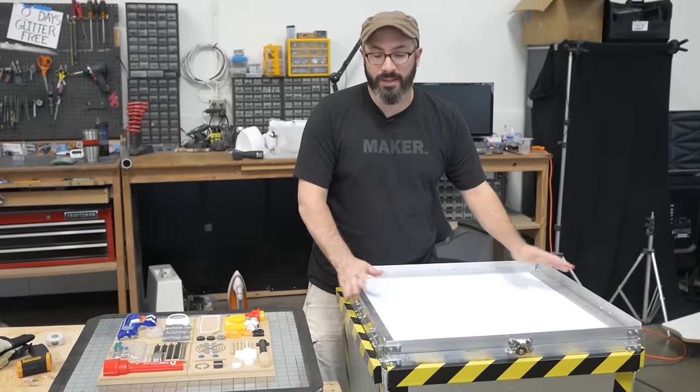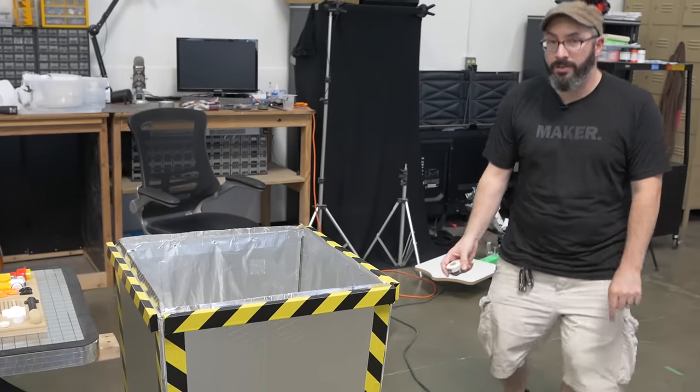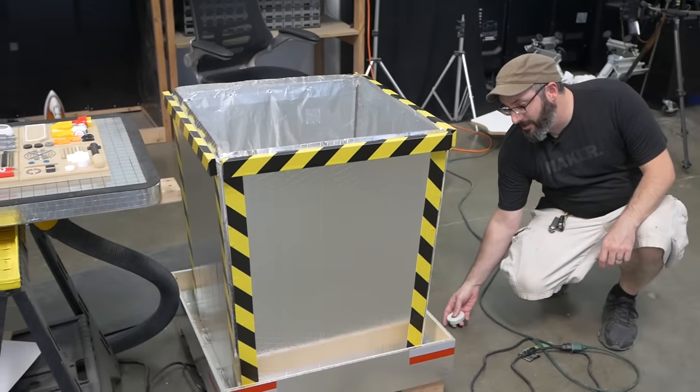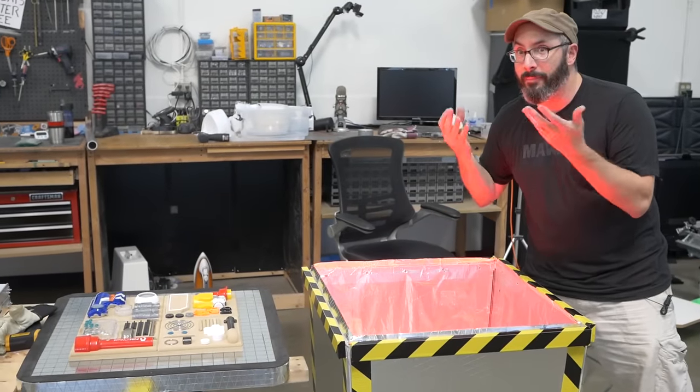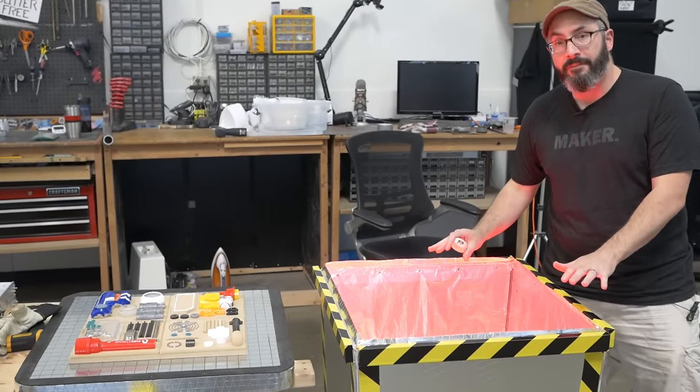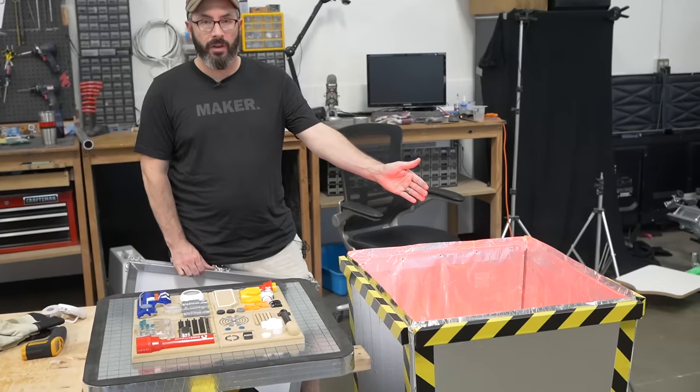Before we start heating our plastic, we wanna preheat our heat box. The infrared sensors for this controller are under the heating elements. So I just turn them on and you can see a nice warm glow coming up. So we're gonna let that warm up for about 5 minutes, then we'll put our plastic on here and get to vacuum forming.